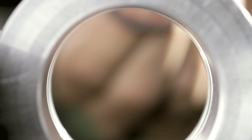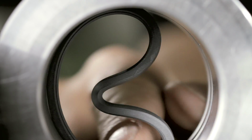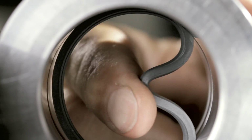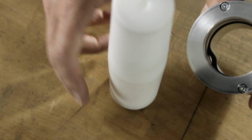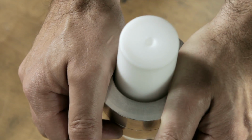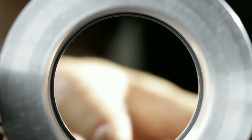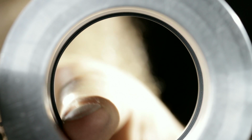Insert the Turcon rod seal in the correct orientation into the closed groove. Reform the seal with the finger in the direction of the groove. The inner diameter of Turcon rod seals must be calibrated in the final stage by slowly pushing a tapered calibration mandrel through the assembled seal. The seal will now sit tightly in the groove.